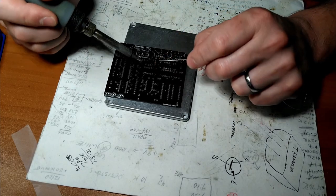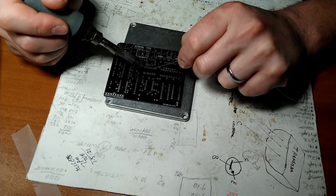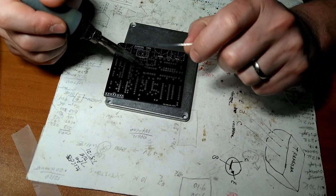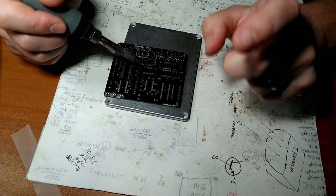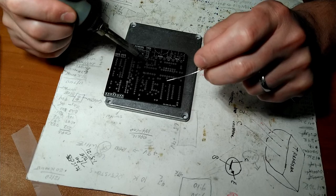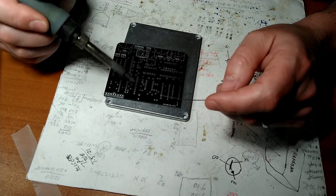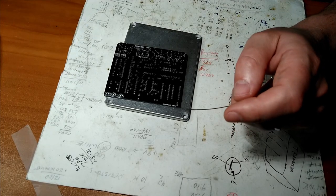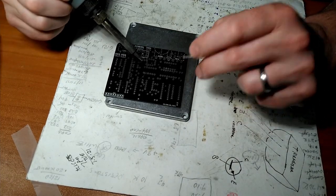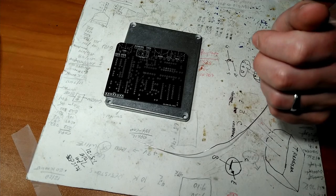And when you're soldering, there's a couple of stages. When it first starts to get hot, it'll melt, and then as it gets a little bit hotter, it'll get really watery. That's when you know you're good. Not just melted, but a little bit watery. You get a feel for it. You get good at it after you've done it, you know, 1,000 times. Yeah, enough said. Figure it out.